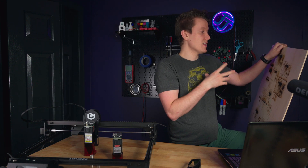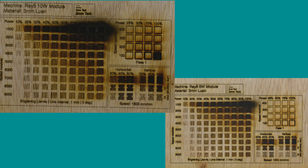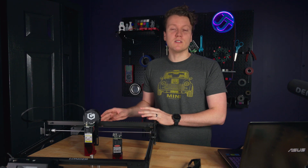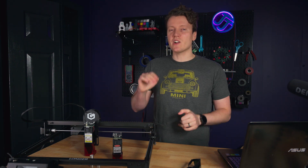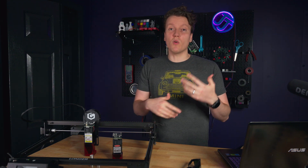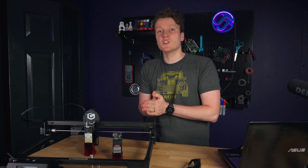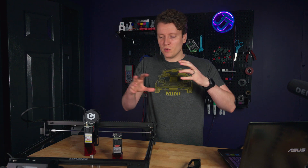When it comes to materials you can cut with this, it's very similar to almost every other diode laser. The big question always asked is: can you cut metal? You're not going to be able to cut into metal, but if something is coated or painted metal, you will be able to etch into it and see the metal underneath. The other class of materials to mention is dangerous plastics. There are certain plastics you don't want to cut because burning into them releases a lot of nasty fumes, so unless you have an enclosure and a filtration exhaust system, you don't want to be breathing those chemicals in.